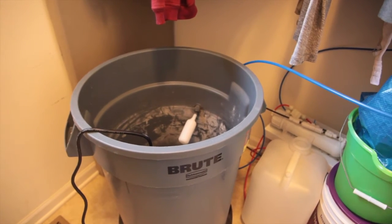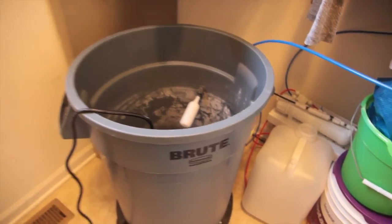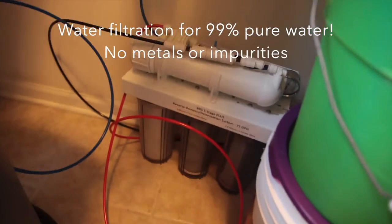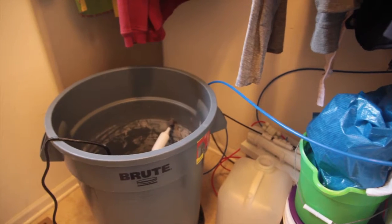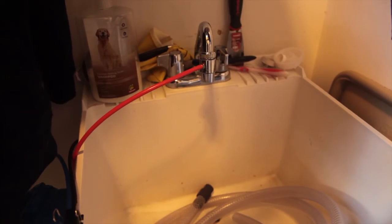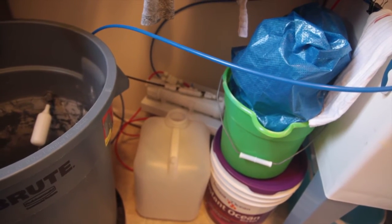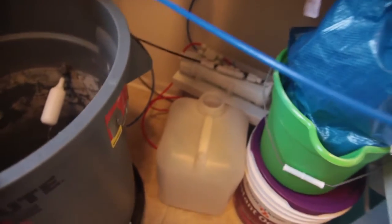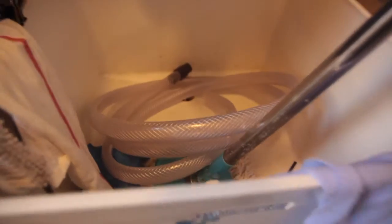When you need water in a pinch, what I did was purchase my own reverse osmosis unit — RODI. I'm making water as I do every Saturday. The red line comes from the sink; the RODI unit comes with all adapters and hosing, which is nice. The red line goes to the unit, out of the unit comes the blue line which is the pure water, and the black line against the wall goes into the sink where the wastewater goes.